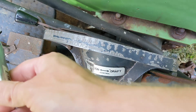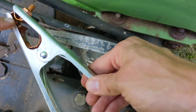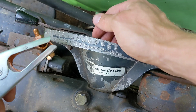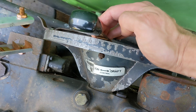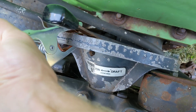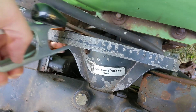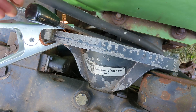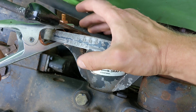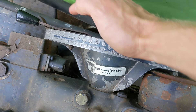Here's a quick hack I found to work around that. This is a Harbor Freight grounding clamp for a welder. It's got a nice copper jaw so it doesn't tear things up too bad, and it also has this little rounded piece — so this is my position control stop. I just set it wherever I need to go, clamp it right there, and as I'm working with hay or mowing, I can just slide it up. It's good enough to clamp, doesn't damage anything, and it's a perfect quick stop. If you're missing that little star knob that appears in the manual, mine's long gone — this is a great little hack to get your position control back and running.